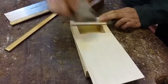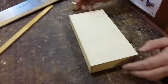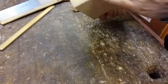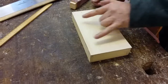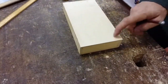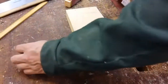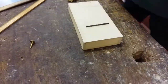Offer up the piece of the sliding top and we want to figure out where we're going to put the screw in so that it will rotate. You can see the grain of the wood is all running lovely in line - it looks quite good when you have that kind of cut where the feature of the grain isn't broken. The screw we're going to use here is a round head brass screw - an old cabinet-making type screw with a screw cup - and where we place this is very important.